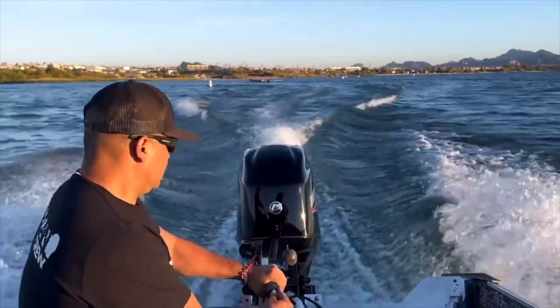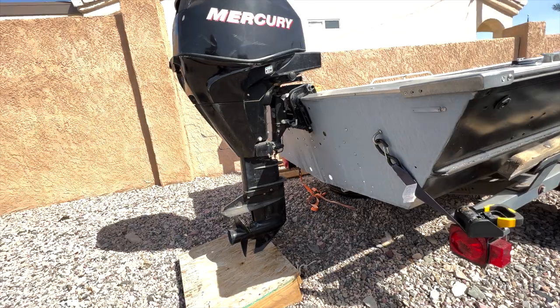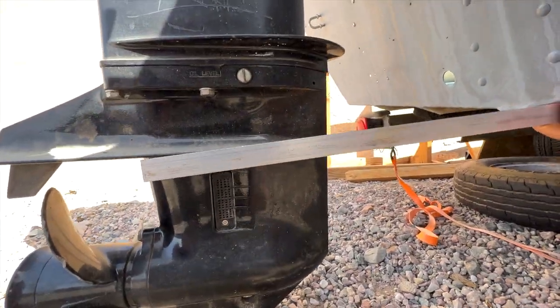If you're on really calm waters, you can actually move that motor up. In most flat bottoms like skiffs or john boats, it's recommended that the cavitation plate stays right at the ledge, right there in the sweet spot. That's supposed to give you the most optimal performance out of your boat.